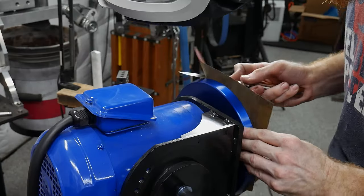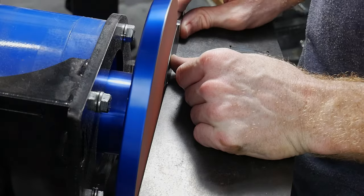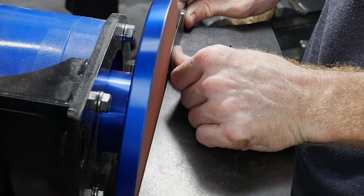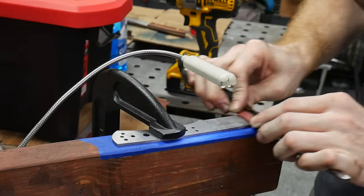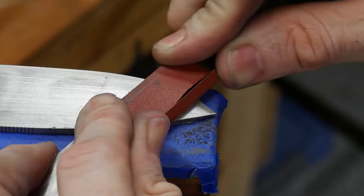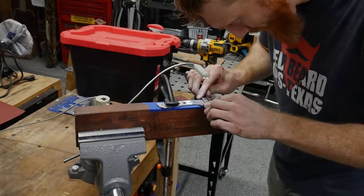Before hand sanding, I like to hit the flats with 320-grit paper on my disc grinder. Bex Armory is also a sponsor of this build-along and I'm pretty sure they'll supply a Vander Sander chassis just like this one to the overall winner. Hitting the flats with the disc before sanding really speeds up the process, and with the blade already mostly at 320 grit after the disc, I get the scratches all headed in the right direction in no time. I'll be stone washing this blade, so 320-grit satin is a good place to stop, but I'd encourage y'all to try around with different grits — I like 600 as well.